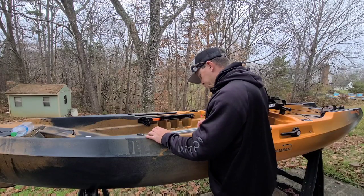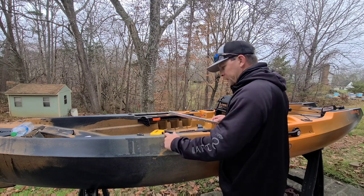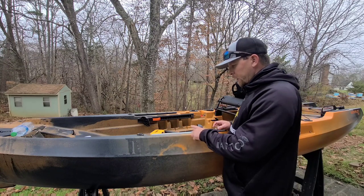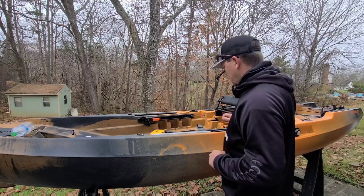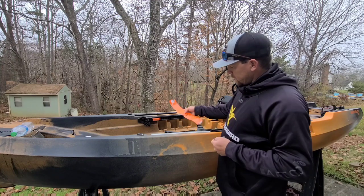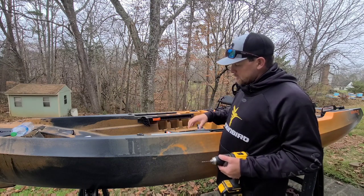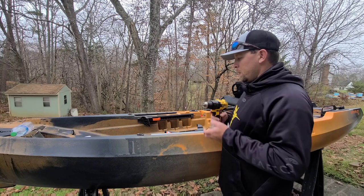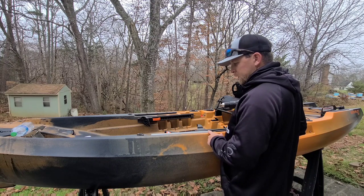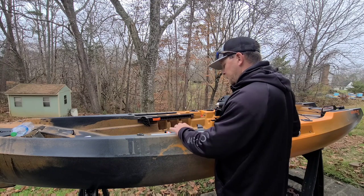We'll get our track lined up again. We have to be careful to make sure we're not going to hit any of the previous holes. Right here I'll go ahead and use the existing hole, but the rest we're going to have to drill new holes for. The gear track comes with all the instructions — we're going to use a 1/8-inch drill bit. It helps to have a Sharpie to mark exactly where you want it. What we're going to do is first drill a hole on each end and put a screw in there, so the rest of the track can't move and everything will be lined up perfectly.